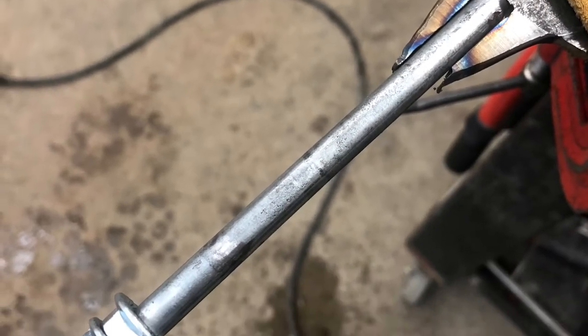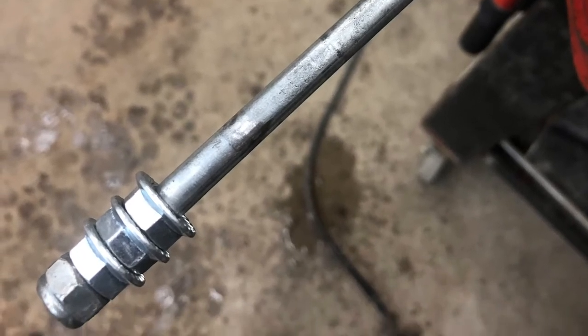I disassemble the knife and make a stronger joint between the bolt and blade, then I use a torch to temper the weld. To be extra, I weld the bolt to the guard fully. It works perfect, and the knife holds up to abuse.